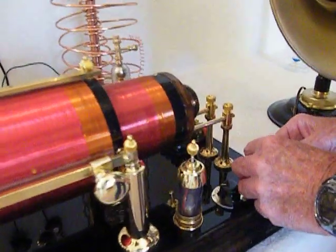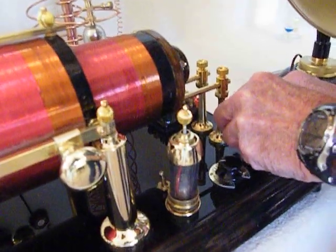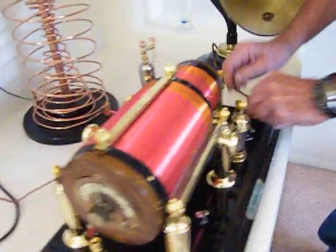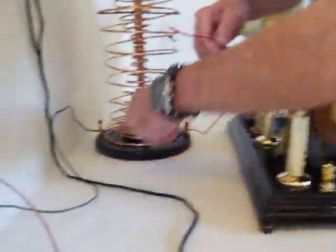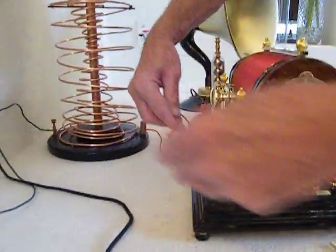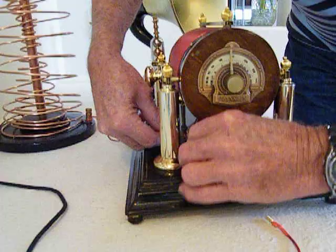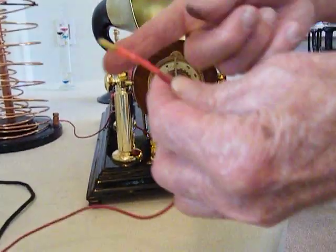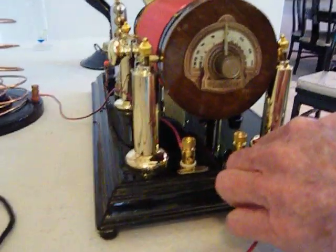This, of course, is the Atwater speaker. Hook it here, and hook it here. Now let's get into the antenna system here. This is the ground — it comes in off the screen wire, goes through this coil, comes back out here, and hooks into here like this. So you've got your ground terminal hooked in. Now let's hook in our antenna, which comes out 125 feet, and it comes right in here through the house, right here.